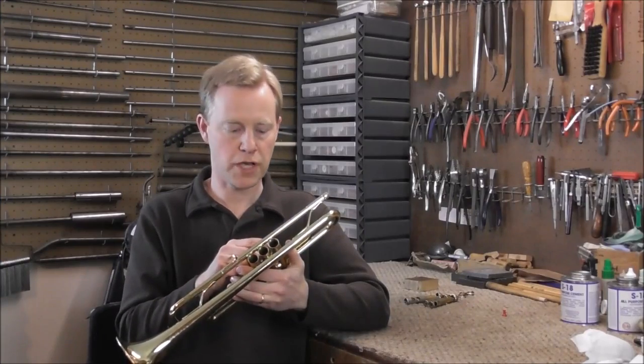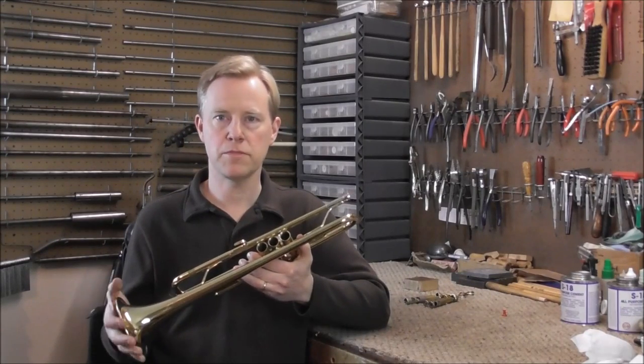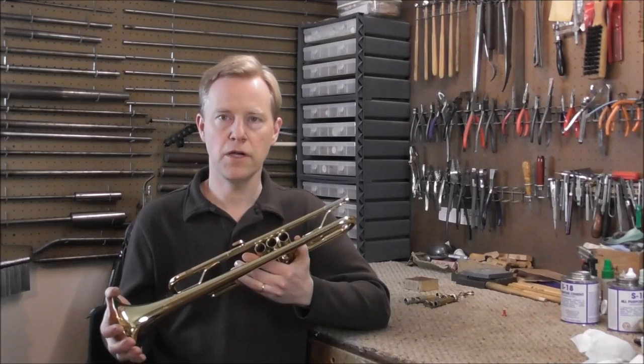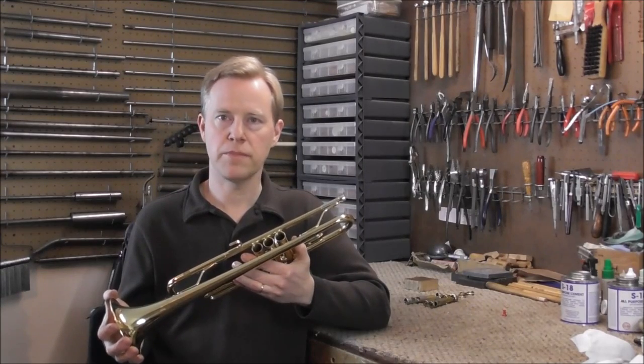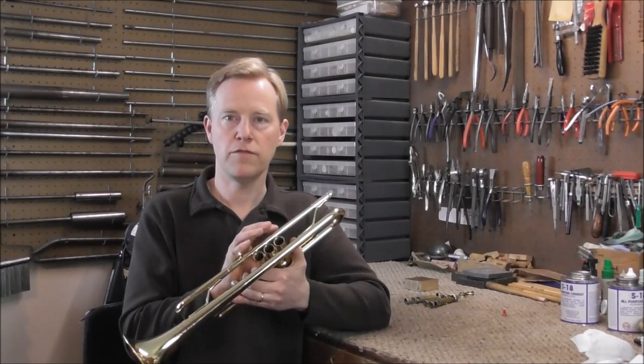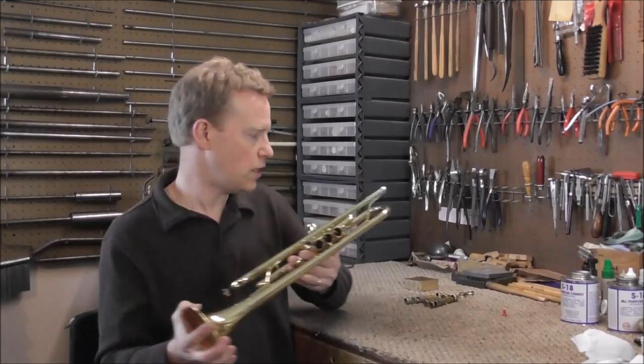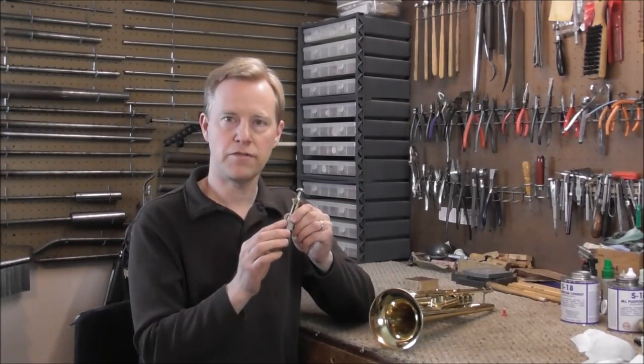If the inside of the casings have scratches all over them, you may wonder if a one-time event — maybe some sand or some grit — got in there and caused them to get scratched up. But when I worked on the valve, I lapped it to smooth it out, and then very quickly after that the valve started getting scratched up again. Since I did not find any grit on the valve itself, I'm guessing that the valve itself is scratching up the inside of the casing.